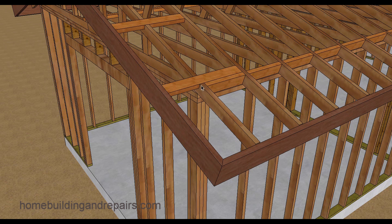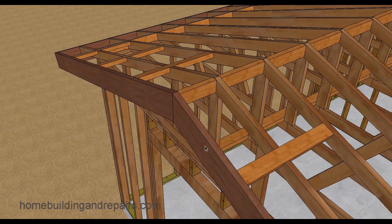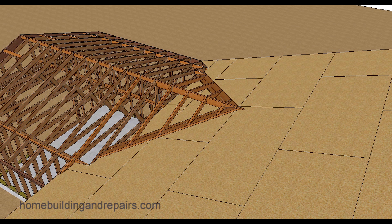Let's take a look at the corner and how this is done. The roof trusses with the lookout — these boards are supporting the roof fascia board. The block here usually needs to be a little lower unless you shape it. I've actually seen people nail these blocks up at the top, and that creates a problem for the roof sheathing, so these blocks need to be a little lower. Here we have a back area without any fill — again, one section.